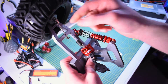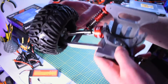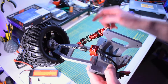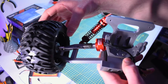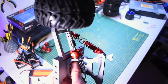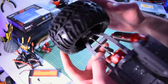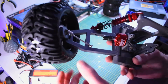I can show you the coupling working — one of the issues I've got at the minute is that it can obviously fall out. That's why I've been working on this piece, which has a little bracket arm that comes from here and attaches to the shock mount. That'll allow me to control the camber of the wheel and also stop the coupling from detaching. With it in place you can see it moves quite freely — really nice. You can hear a bit of noise, which is mostly from the universal joint, as it's got quite a bit of movement when you wiggle it around.